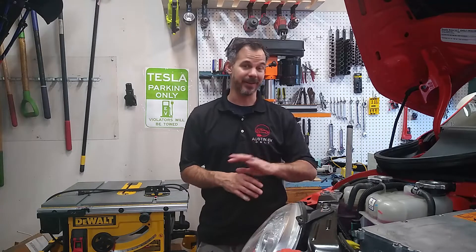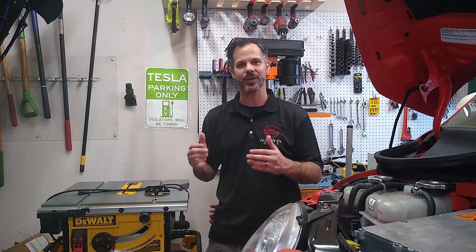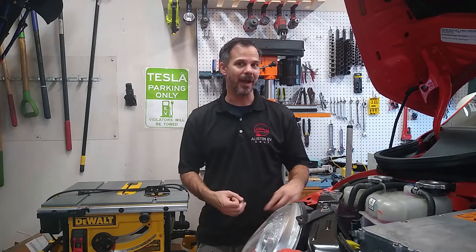This is a circa 1980s Vespa, or Piaggio Ape, and because of that it has its original 12-volt battery, which powers the headlights, brake lights, turn signals, things like that, and that battery is pretty far gone. I need the customer's permission to replace that battery, so until then I'm just going to hook up my DC to DC converter in an always-on state. This video is all about the DC to DC converter — getting it installed, getting it wired up, and some challenges I come across along the way trying to put it into an always-on state.